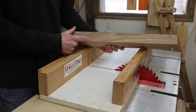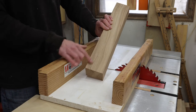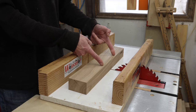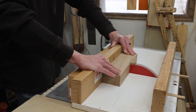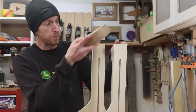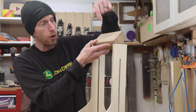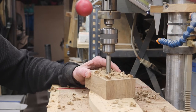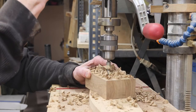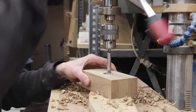This piece does have some checking here; I'm going to try to cut that away. I want to keep this as solid a piece as I can. There's also another crack, so the section I'm going to use will come right out of the middle. This block will connect the two uprights. Now we just need to mark out and drill a hole right down through the center. This first hole is not going all the way through — I'm going to stop just shy of the bottom, then switch to a smaller drill bit and finish drilling all the way through. This will leave us with a slightly stepped hole.